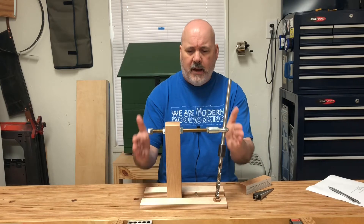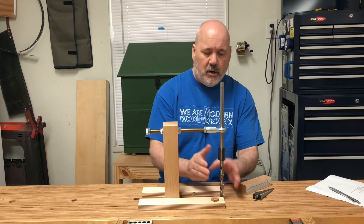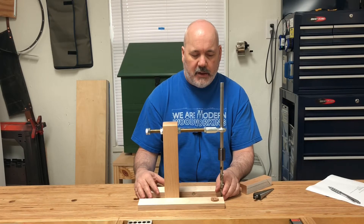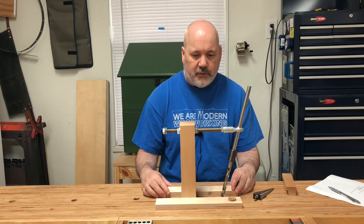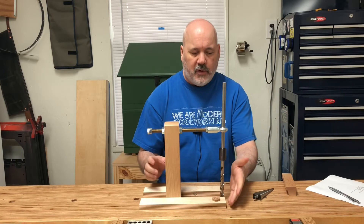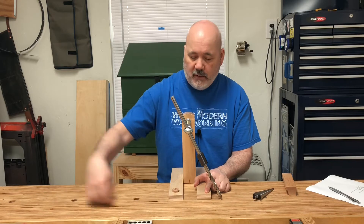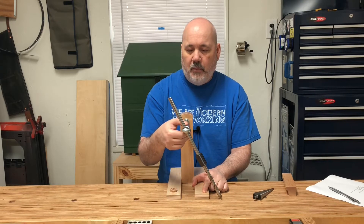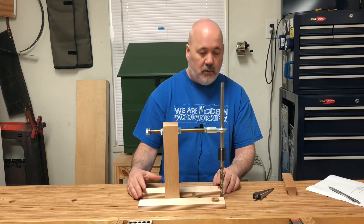A little bit about how I have this calibrated: the point where the drill and shaft are 90 degrees to your work surface is right at the end of this runner — that's what I call the zero point. That enables you to use the setup block to accurately set your angle. If you needed to drill at an angle greater than 30 degrees, because the zero point is at the ends of the runners, you could align the ends of the runners to the sight line and loosen the jam nut to move the rod end bearing slightly, getting angles greater than 30 degrees. Of course, you'll need a drill bit capable of drilling at that angle too.